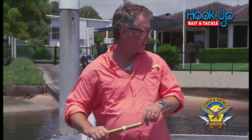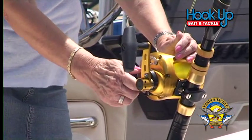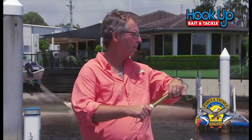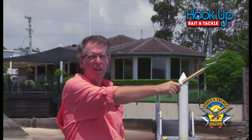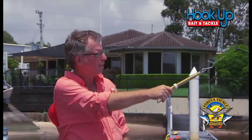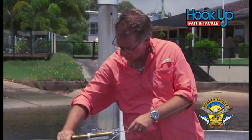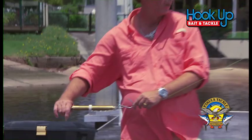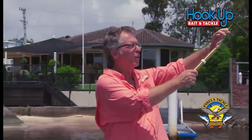And now we've got 6 kgs. Okay, we'll back it off again. I think she went 2 clicks. Okay, wind up, please. Generally the ratio is that 1 click is about 0.5 kg to 1 kg. So when we pull the scales again at walking pace, let's see what it is. We've now got exactly 5 kgs. Wind up again, please, Joe. Okay, we've set the 1/3, we've set strike.